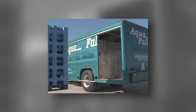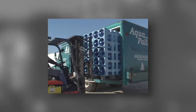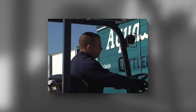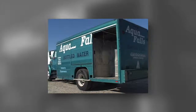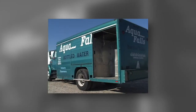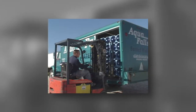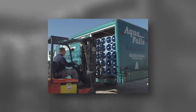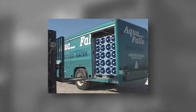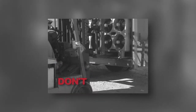When loading the ProStack racks into the rear bay of the route trucks, forklift drivers should be sure to load the rack toward the front side of the bay, which is toward the cab. This will minimize movement of the racks in the back bay. In some cases where the route trucks travel on rougher roads, retainer bars are added to the floor of the truck bay to prevent the racks from shifting toward the bay door. These retainer bars can cause damage to the lower pallet base if the ProStack racks are not properly loaded. The ProStack rack should be completely placed inside the truck bay, clearing the retainer bar before lowering the ProStack rack into position. Never rest or push the ProStack rack on the retainer bar as it can cause damage to the base of the pallet.